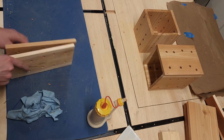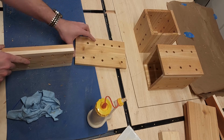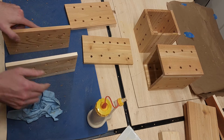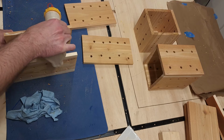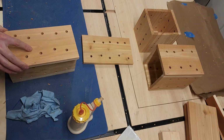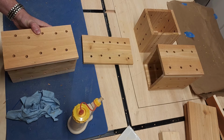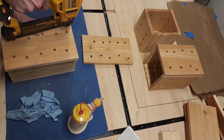And finally, the 10-inch box. Get your 4 pieces ready to go. Get that lined up. And again, it's rinse and repeat. Same thing. You will be adding glue to just the first one, placing the other piece on top, using the other one as leverage to keep your angle as straight as possible. Tack in the brad nail. Here, definitely you're going to put 3 on each side just to ensure everything is lined up perfectly.